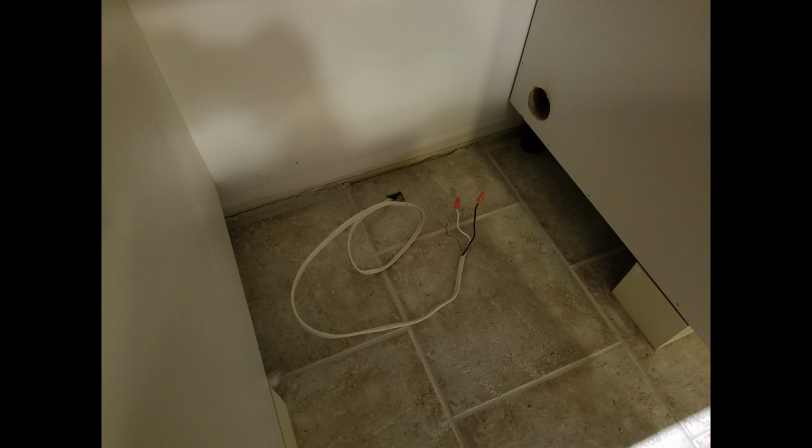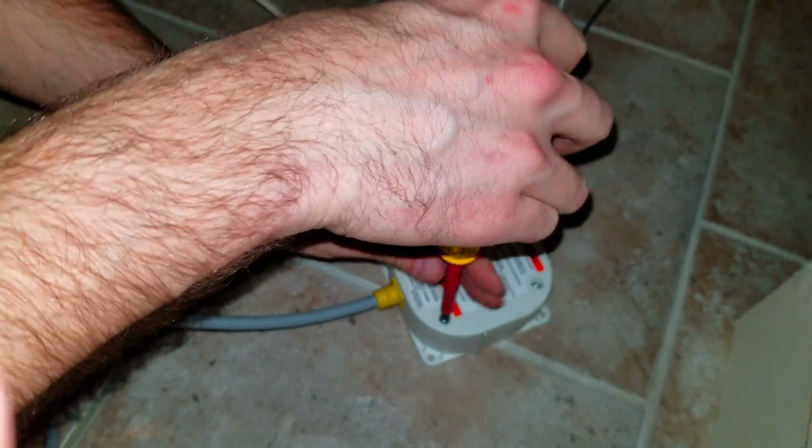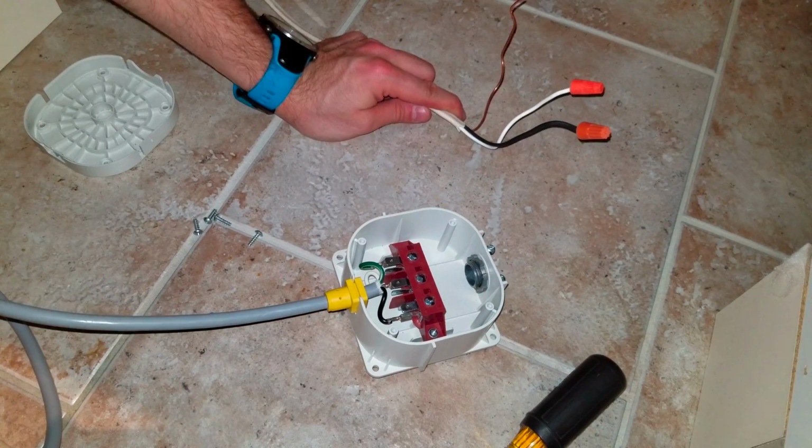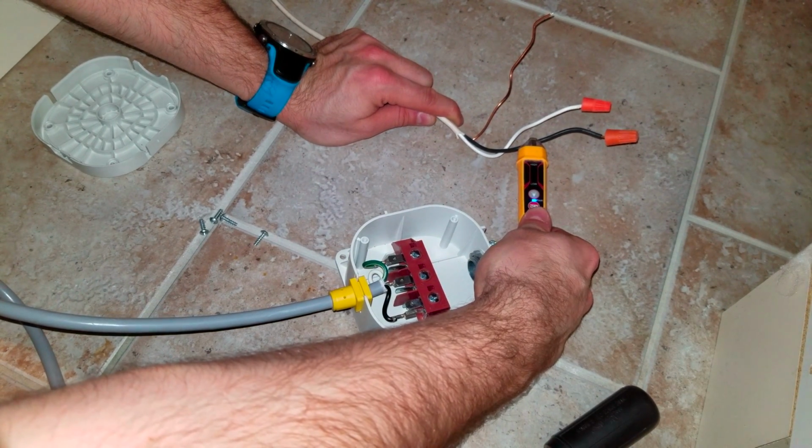This is where the dishwasher will go. You must have electricity coming here, and a hole to reach the kitchen sink piping. This is the electrical box attached to the dishwasher. Make sure there is no electricity coming to this cable before you play with it.